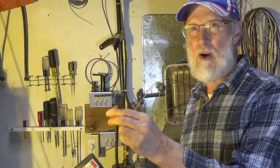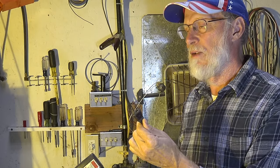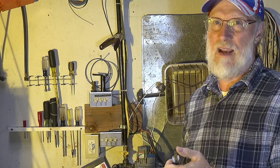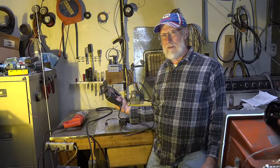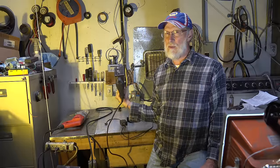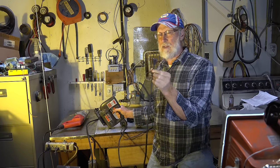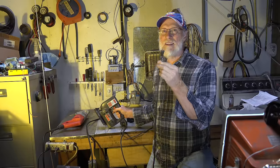This other tool has a two-prong plug. It's old enough that it doesn't have the wide and skinny prongs — the wide one is for neutral, the skinny one is for hot. This tool is entirely plastic and is called double insulated — it actually says 'double insulated' on it. You're not going to get shocked from this tool. Because it doesn't have a ground, only a hot and neutral, this would be a floating ground — it's not connected to anything.